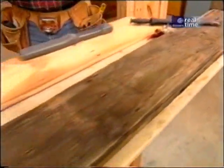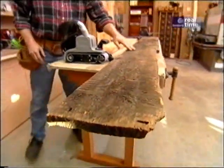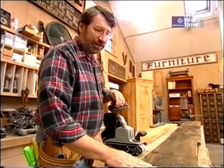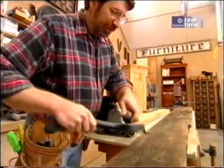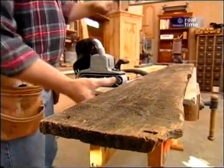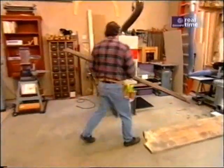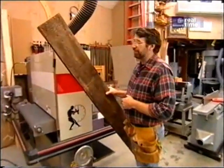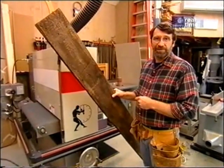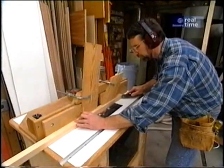Once the nails are out, that's not enough before you run it through your planer. There's a lot of grit on these from being handled and stored. If you run it through your planer, it's going to knock the edge off. There are several things you could do to remove that grit — you could take a big scraper and scrape off the top layer, or you could take a belt sander and hand sand it. Since I have a wide belt sander, I'm going to use that, and I'll run it through with a very aggressive belt, like a 60 grit. But before we use any power tools, let's talk about shop safety. Be sure to read, understand, and follow all the safety rules that come with your power tools. Knowing how to use your power tools properly will greatly reduce the risk of personal injury.